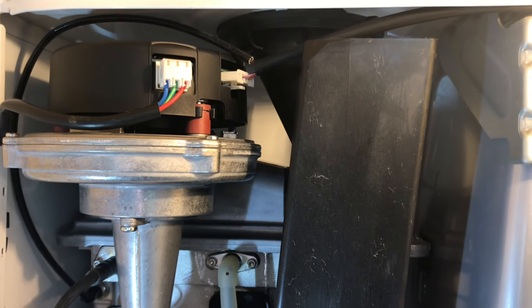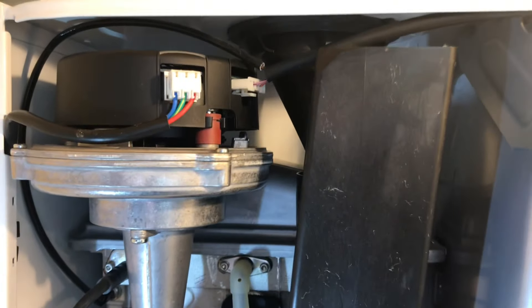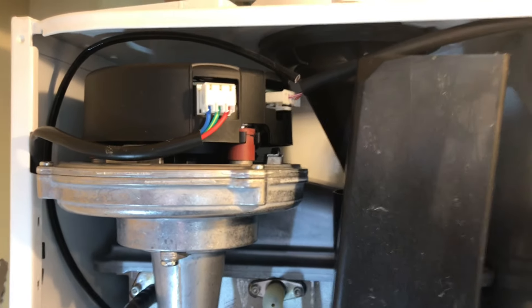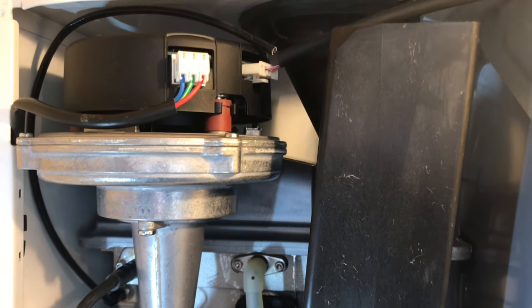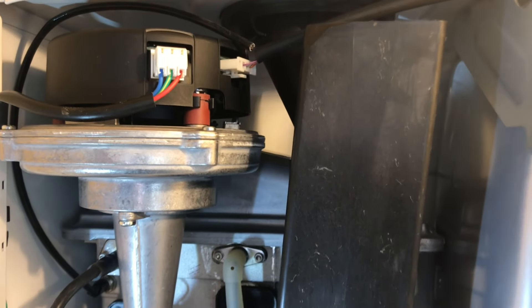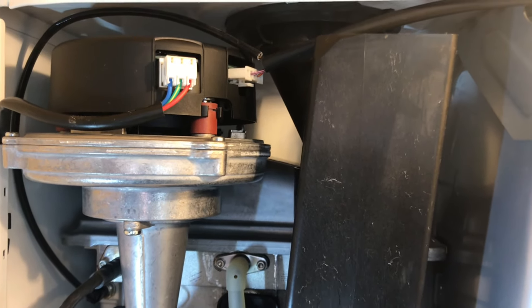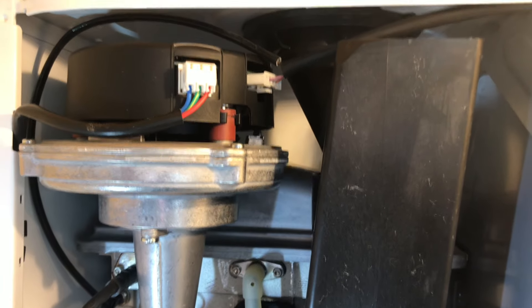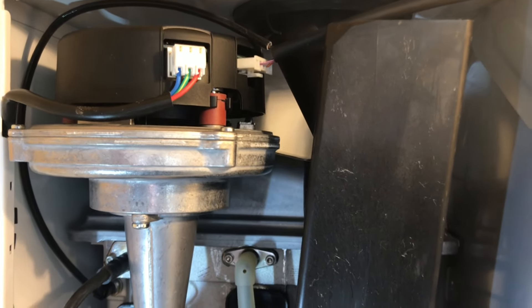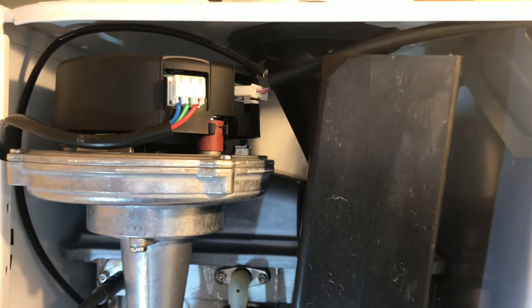Disconnect the leads and check for 240-volt AC — that's an AC connection. However, there's a circuit board inside that fan, and when it's running it converts 240 volts into 330 volts DC. Unlike the non-condensing boiler fan which has a readable resistance through its coil, this fan has no readable resistance because it has a circuit board with two inputs. I'm going to talk about the pulse width modulation signal shortly, but first a quick overview of how this fan works.